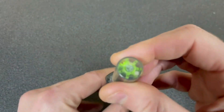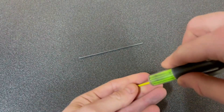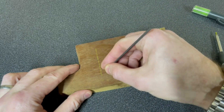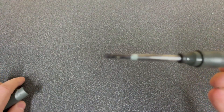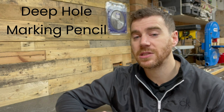This one came with a separate storage pot as well for leads, and it included standard lead as well as yellow refills. These yellow ones are definitely more crumbly than the standard lead, but it's perfect for marking onto darker woods as you tend to struggle to see the standard lead. I did get this deep hole marker pen in the set I bought, but I'm not so keen to recommend it as the ink leaked quite a bit on mine and it dried up fairly quickly. It has been useful when the pencil wouldn't mark on the surface, such as when marking into brick, but it's definitely not as useful for your workshop in general. I do swear by the pencil though, and have linked to the deep hole marking pencil in the description.